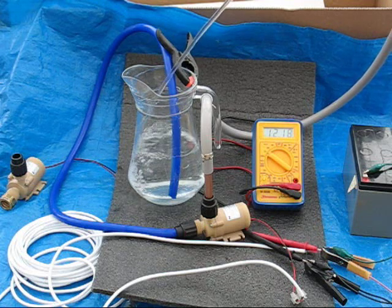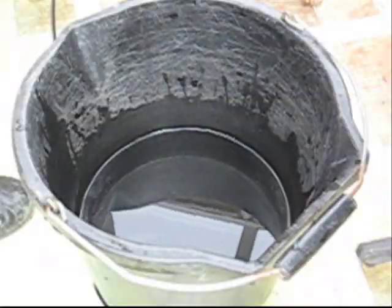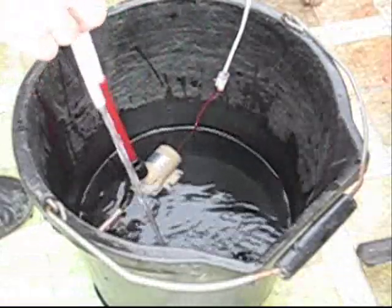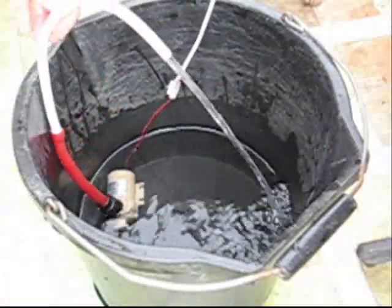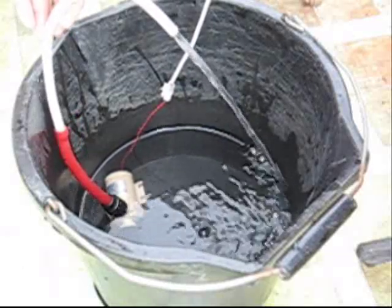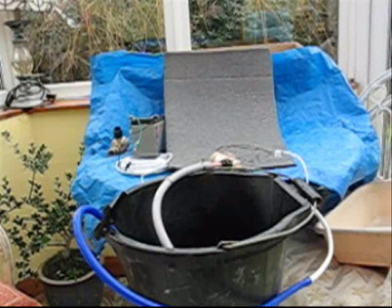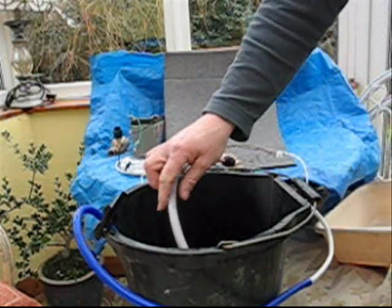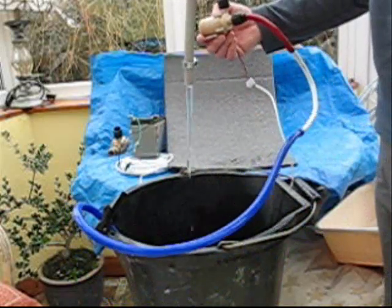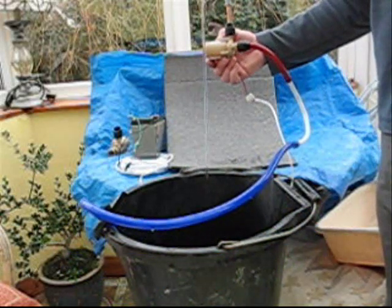The flow rate created is more than enough for my own 40 evacuated tube solar panels. Although not sold as an immersible pump, you can see that the pump runs quite successfully underwater, and I have run one for several weeks in tests without incident. Once primed, the pump can pull water up and push a head of over two metres. In the closed circulation loop, of course, this head does not apply and much greater heights are achieved.